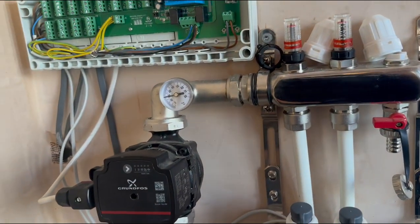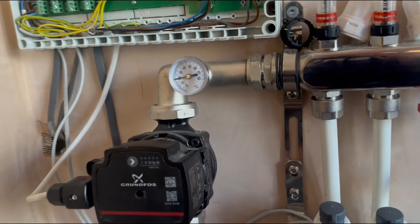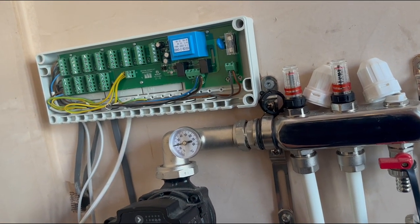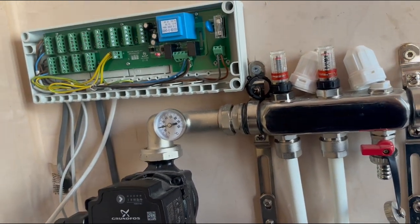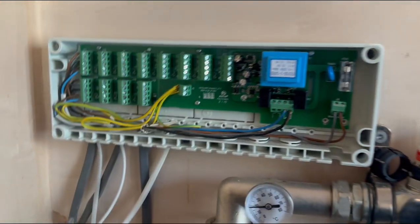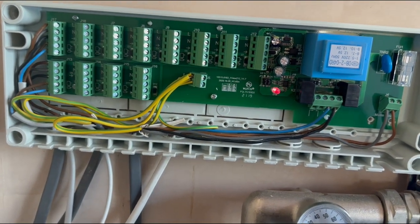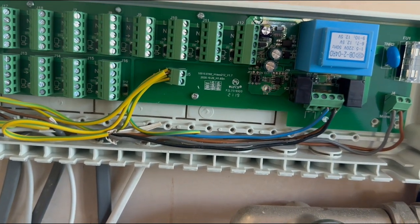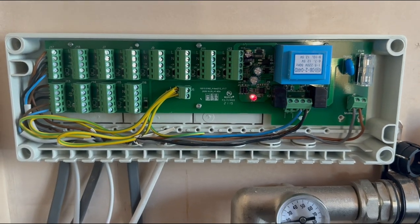There's a hell of a delay on this system. An electrician's life — a lot of waiting around. The main issue is there's no permanent live up here, so I need to figure out if I can sort that. I did spot a gray wire in the wiring center that's not doing anything — it's part of a three-core — and I'm hoping it goes down to the time clock so I can make it a permanent live to power the zone valve and the control box.